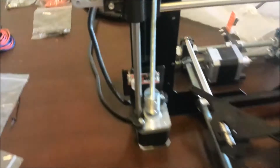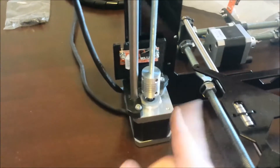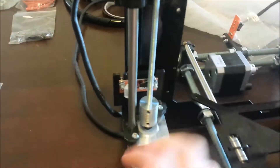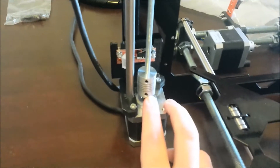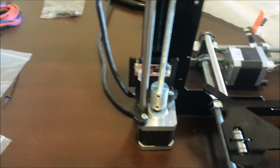With the Z axis we have the 5mm threaded rod, the 5mm coupler and the Z axis stepper motor, with the grub screws joining the two. I've just used a bit of thread lock or loctite, as I've had grub screws on other projects rattle themselves loose over time.